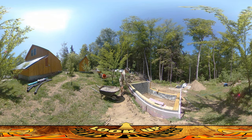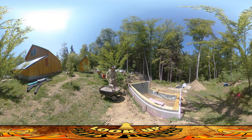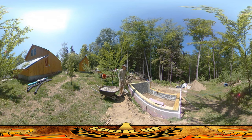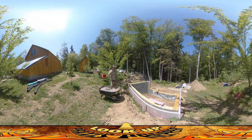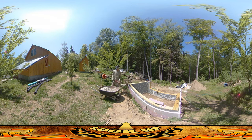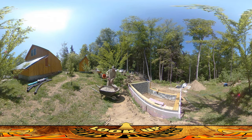I've just been pilfering gravel from my driveway and dumping it down on the side here. I've got these sticks holding the foam up against the foundation because what's really a pain is if there's any kind of gap and any gravel goes back there, you're never getting that foam nicely up against the foundation again unless you pull the whole thing out. I already explained how lazy I am, so I've got them propped up so I don't get any rocks back there.